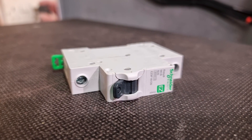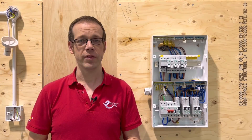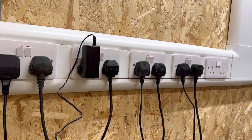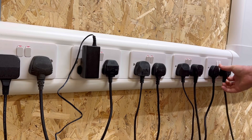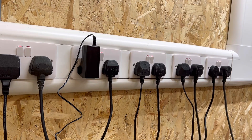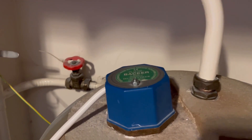There are two ways that overcurrent can be caused in a conductor. The first is if too many loads are connected to the circuit. This is referred to as an overload. Now for most circuits, this is relatively unlikely. Let's take an immersion heater as an example.